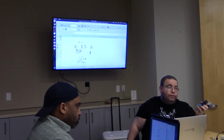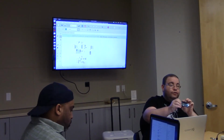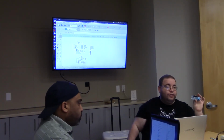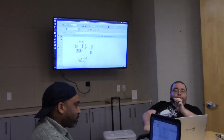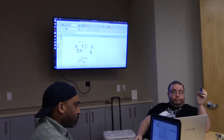The idea here is that I'm going to be able to store pixels on the RAM chip and splat them out to the screen. There's also enough pins here for a nice little tie to a Z80 or a 6502 bus, 8-bit interface thing. You can talk to it like one of those LCD screens. It's got a data instruction. 1 megabit is an interesting number.